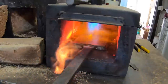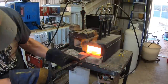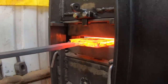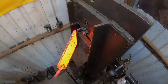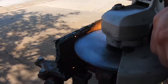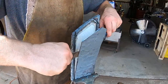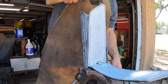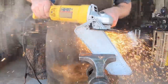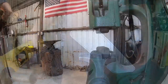We'll go ahead and weld the whole thing up so it's more or less airtight minus some very small pin holes — we don't want this thing to blow up in the forge or pop like a balloon. Getting this heated up, you can see down the center it wasn't as hot as it needs to be, so just making sure everything is heated up to forge welding temperature before we get it over to the press. I did this multiple times — probably half a dozen — but didn't compress it very much each time. The idea is to get these all forge welded together. Cutting the can off here, I used the white paint — that's my favorite method for keeping the can from welding to the contents, and it worked great. We'll get this billet out — that's quite a chunk of steel, fairly impressive.